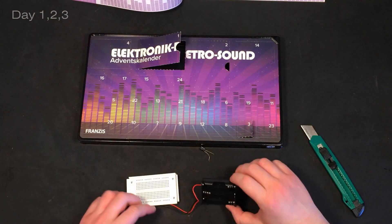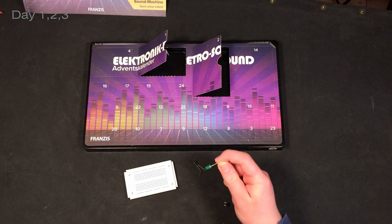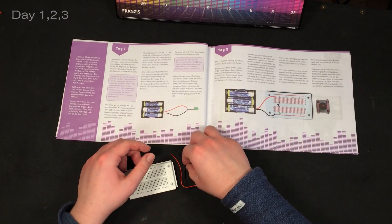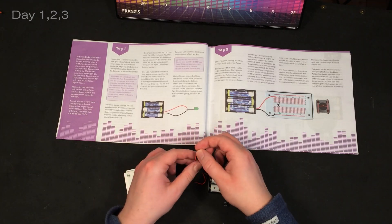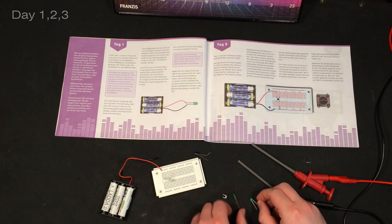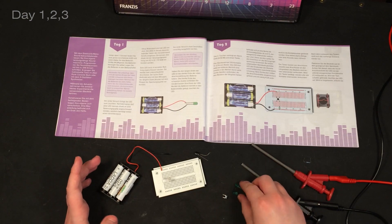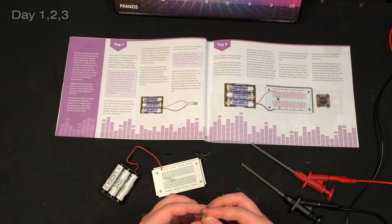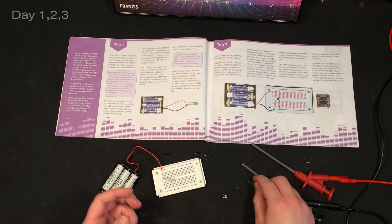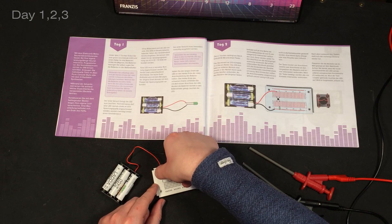There's supposed to be a green diode in there but it's missing unfortunately. I got a diode from my Arduino kit and some batteries. Day one is just get the diode to light up and it's not working. After breaking two diodes with too much current by directly connecting them to the battery pack, I realized the diodes in this kit actually have an inbuilt resistor. The ones I took from another kit don't have that, so I need to add a resistor to the circuit before it's safe to plug the diodes in.